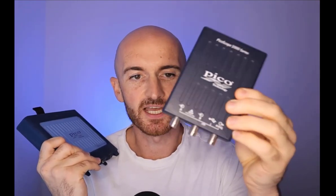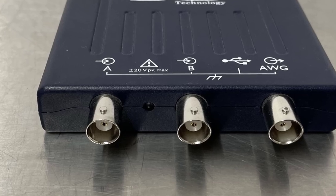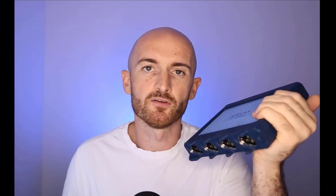In the training we show you how to get the full power out of this thing. However, there's one thing you need to be careful of and that's with the grounds. On the inputs, on the BNC, the outer bit is actually the ground and each one of these is connected together — it's known as a shared ground or a common ground. However, on the 4425A and a lot of the other most recent automotive oscilloscopes, they have something called floating grounds or individual grounds, where each of the grounds on each channel is independent of the other.